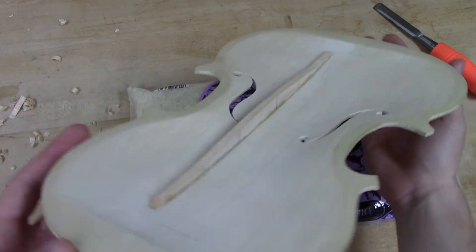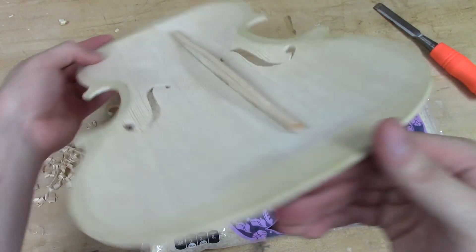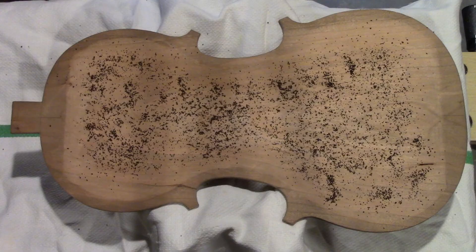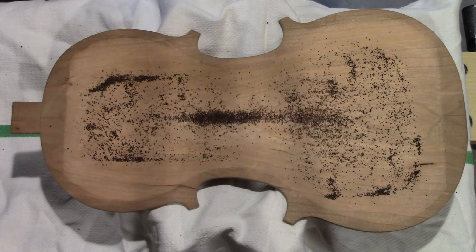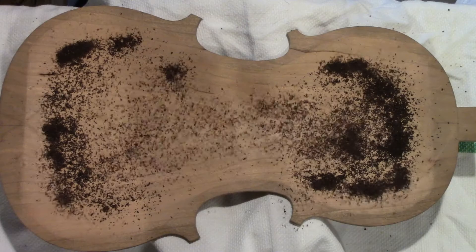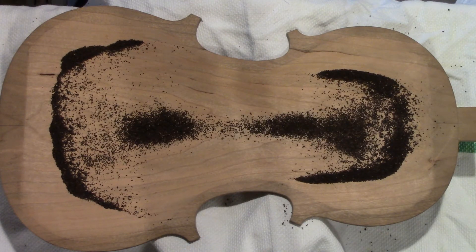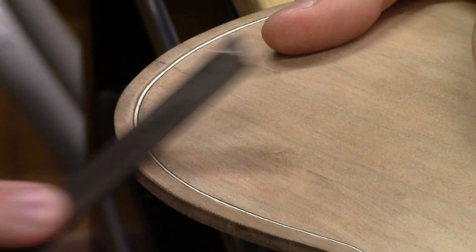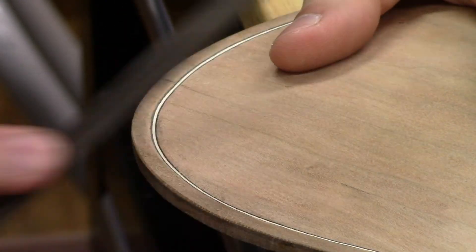You can see the final plate here — pretty much done. You can see the nice taper; it still needs cleaned up on the inside. Here's the Chladni pattern again — it's a little less curved on the top; I think that's fine. But look at the back plate — this is supposed to look the same with that curve at the top, but there are two vertical lines. That's bad. I thin out the top, do it again, and it looks better. I just thinned it out trying to change the modes as little as possible. The relationship, if you're curious, is a semitone apart — the back plate is a semitone below the front plate. People say different things: some say exactly on top of each other, some say a semitone above, some say a semitone below. I did a semitone below just because that's what I was closest to. I also rounded the corners and edges, which really helps the look of the violin a lot — it does change the modes a little bit, but not the modes we're most concerned about.